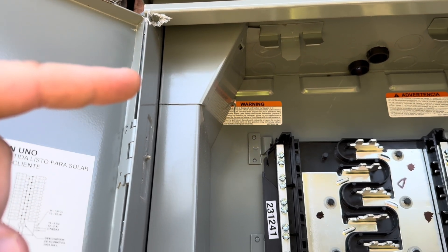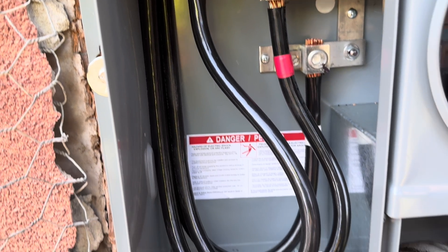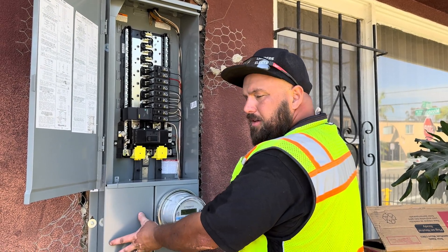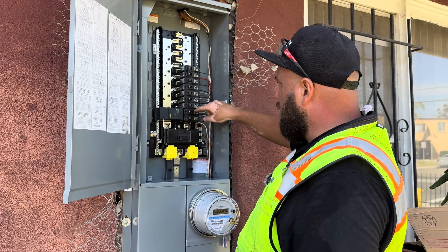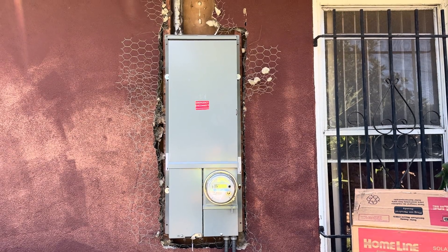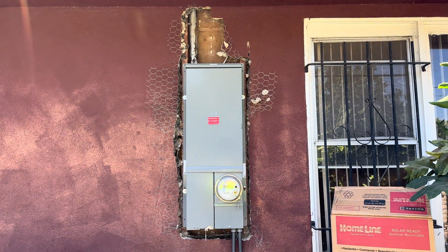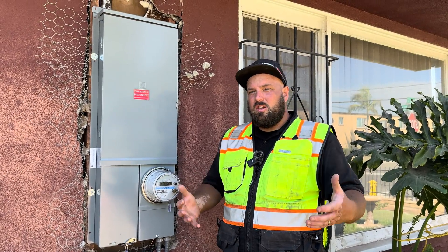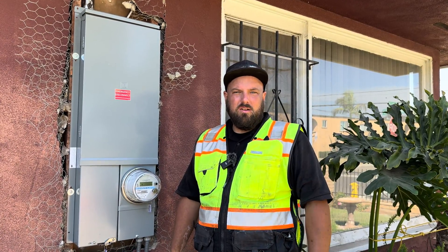A nice feature in this panel is the tunnel kit, which covers the conductors all the way through the panel until they reach their own compartment where the wires land. Once your main conductors are landed and everything is closed back up, start making up all your circuits, put all your breakers in, and train your wires nice and clean so they look really good. Make sure everything's labeled, the weather head is done, and the utility company has turned you back on. Thanks for watching!